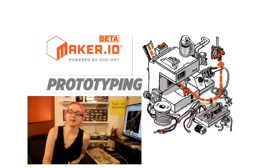You will have to hand assemble your prototypes. You will eventually get into machine pick and place assembly, but your first 10, 20 boards, you're going to be hand assembling them. There ain't no way around it. And it's a good idea for you to do it and not outsource it, because you can do testing at every step, rather than build the whole thing and find out there's a short somewhere. Do it step by step. Test the power supply, then test the microcontroller, then test one of the sensors and test the LEDs. You do it step by step.